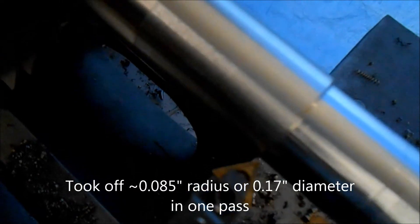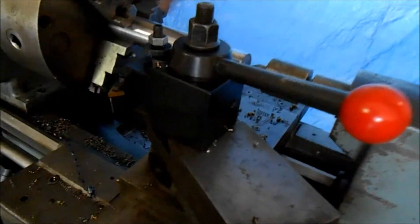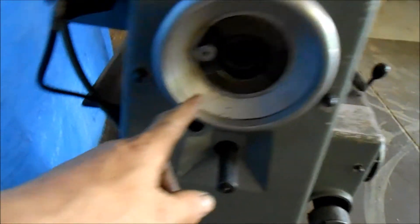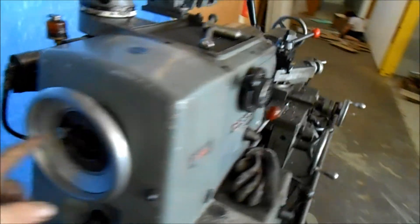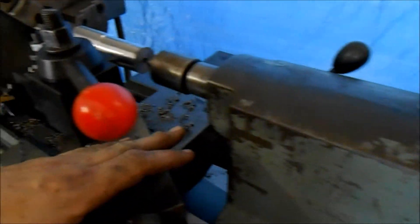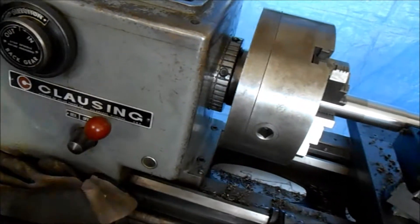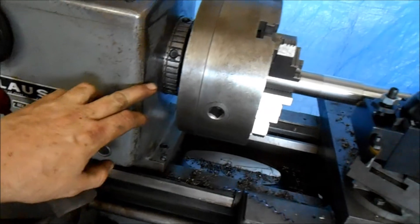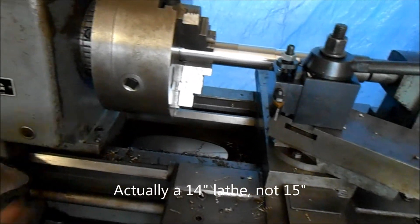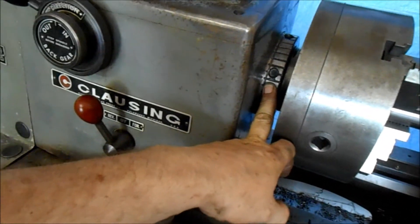It's a three-cornered carbide tool. The spindle is a 1-3/8-inch ID. So we're actually taking this down to just slightly under 1-3/8 so that we can flip this around and put it in the other way. The nose on the spindle is an L00. It's a 15-inch lathe with an L00 nose — that's kind of a nice combination. You've got the strength from the fact that it's a 15-inch and you can take a tremendous cut with it. And the L00 is great because there's a lot of tooling out there for that size.